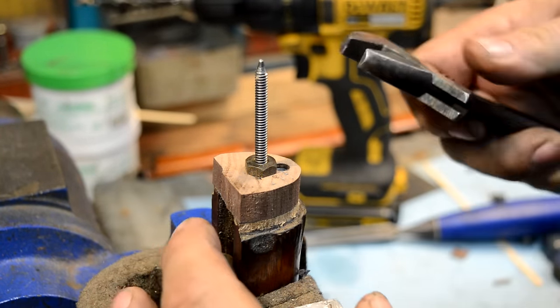Okay, so we'll get this rubber off of here. Okay, we'll pull this back. Take this out of the stock. Now we're gonna use the weight. Let me go ahead and close this up. We're gonna use the weight of the gun against itself, and we're just gonna drop it on the bench like that and allow that weight to pop it free. And we've got ourselves a nice, we'll pull up on this now, but there it is, it fell out, which means our mold release worked.